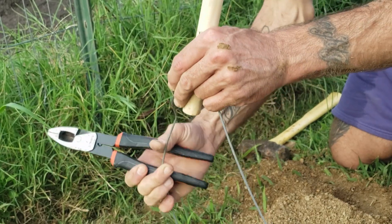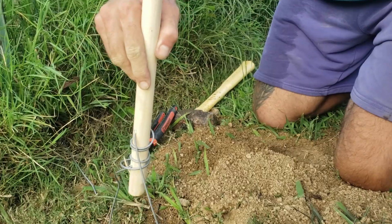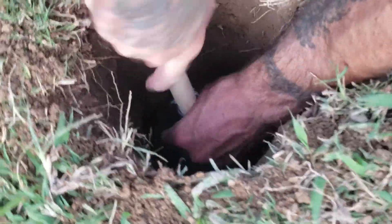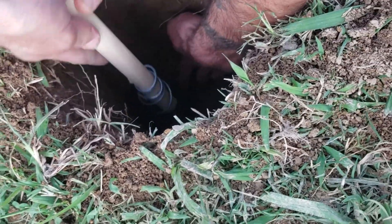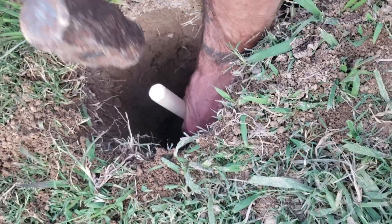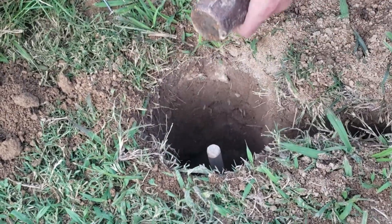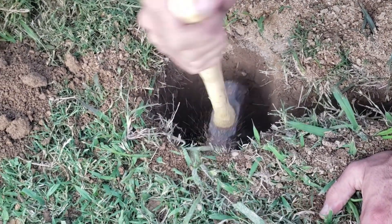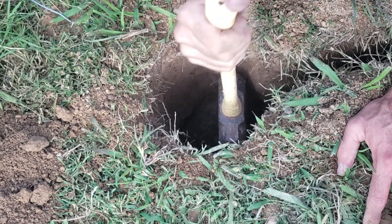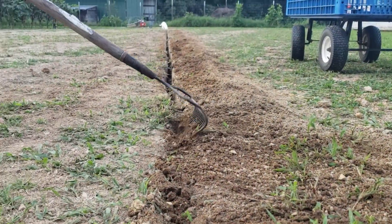You can see I've gone through the holes in the stick. I'm going to cut a little bit extra off, and that bottom piece will go down into the ground into another post hole that goes much deeper than the furrow. The trench is about 12 to 14 inches deep, and your termination point will be down around 20 inches because you'll drive it in further and get it as deep as you can in the ground for your negative point. Then you refill this hole with dirt, as you will the trench.